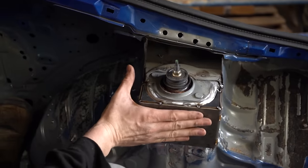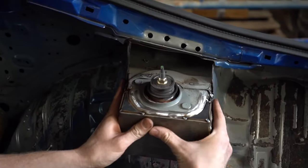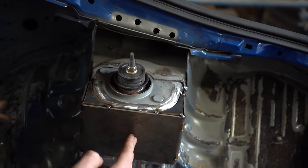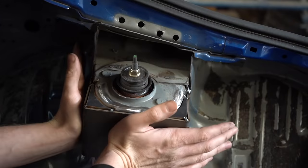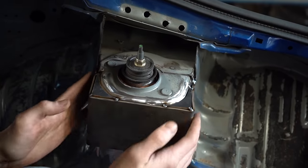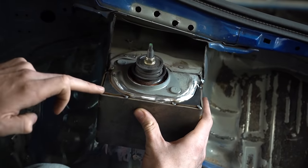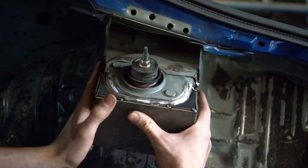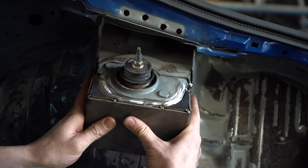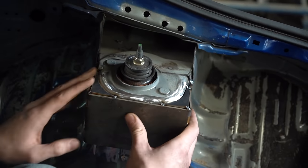So this is the rear base plate design on the 350Z. We've decided to box in the rear strut towers so that we can add a strut bar, the backstay, and join into the main hoop, all with a nice flat contact spot for an easy weld and easy fabrication. And plus it cleans it up, strengthens everything. It's easy to weld with good prep. This is a good example of what to do on a good roll cage base plate and also how to strengthen the chassis and brace the rear suspension points of the car.